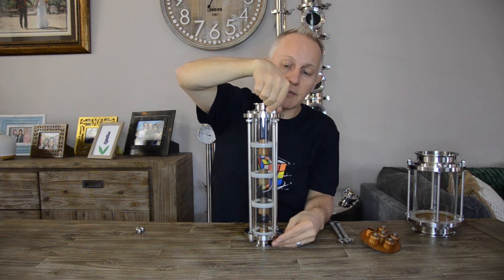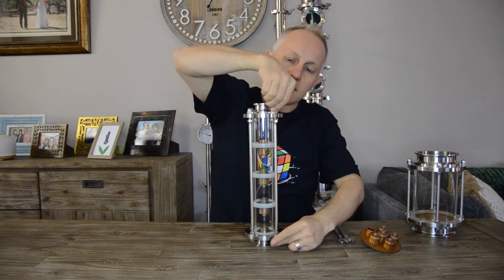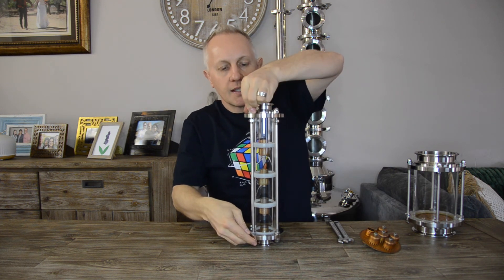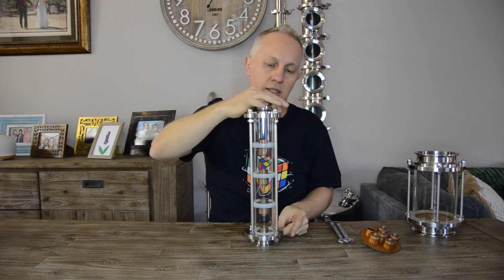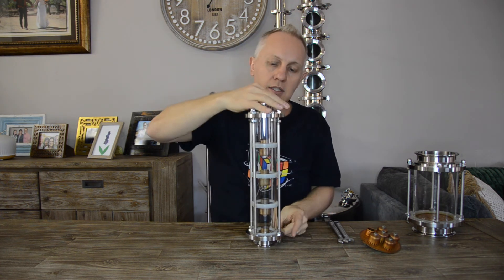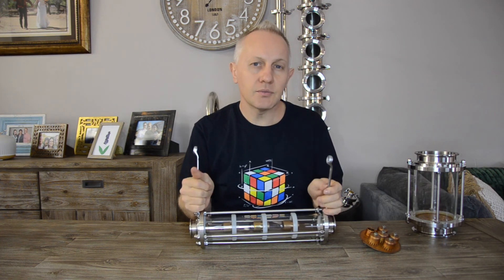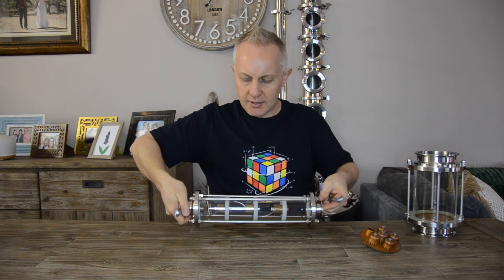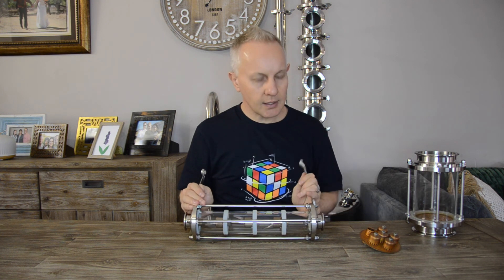It does help when the studs are slightly loose. Also make sure when you insert it on top it's not overlapping and everything feels flush. I fasten the bolts using my fingers, not pulling up too tightly yet. As I tighten with my fingers I check the opposite side every now and again to make sure I pull it up nice and straight, until I can feel with my fingers I cannot turn it anymore. Then I go to the 13-millimeter spanners. When I come to the last part where I tighten it up nicely, I like to put it on its side — it just gives me more control over it than standing it up straight.